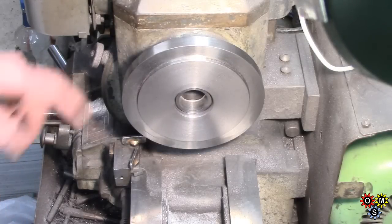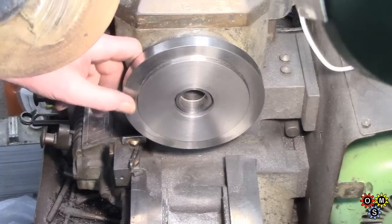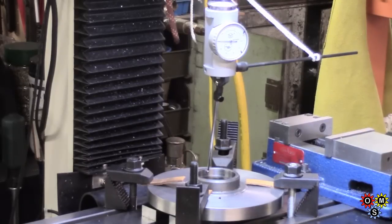The next thing, which I don't really look forward to, is getting the whole series done, because I'm very tight for space on the Y-axis on the mill. Anyway, that's hopefully the lathe aspect finished, and next time we should be in the mill whenever that is. I've got this pretty much dialed in now — graduations are five tenths. As is often the case, even the machined cast iron surface is not necessarily absolutely perfect, but that movement there — I can't get it absolutely static — it's probably about a tenth. So I'm going to go with that and let's get zeroed.